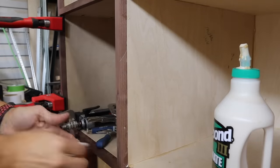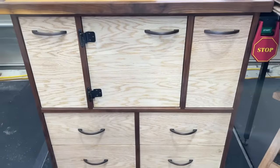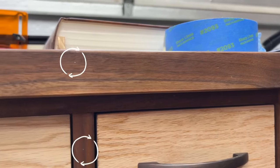If you saw my router table build, I used the pin nail to put on the trim — the walnut trim on the front — so that would hold on there until the glue dried. I never went back and filled those holes because there's no need to, those pin nails are so super small you can barely see them. A pin nailer is excellent for ornamental pieces like small boxes, or even if you're going to be putting on really detailed trim.